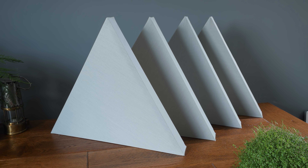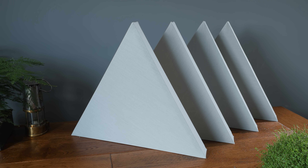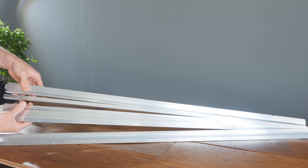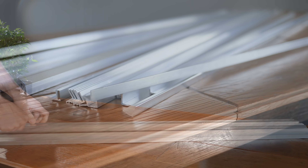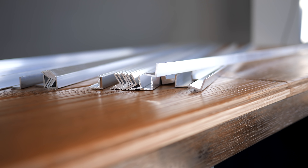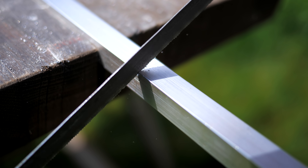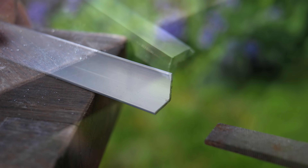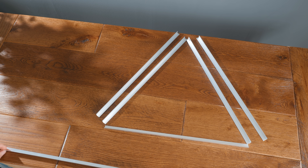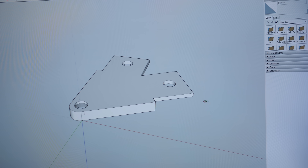The first thing we'll tackle is making the frames that give the panels such a modern, slick appearance, and to make them we'll be using, perhaps surprisingly, angled aluminium bars. This is so that the resulting frames will be very lightweight, acoustically transparent, and be easy to put together. While not quite as cheap as using something like wood, it is still very cost effective and should work out at about $5 per sound panel. Once you've got six bars of equal length, it's time to attach them together using a little 3D printed bracket, which you can find a link to in the description.